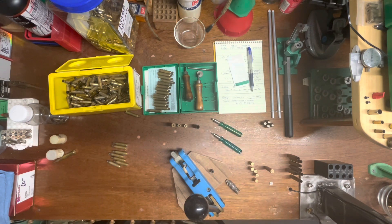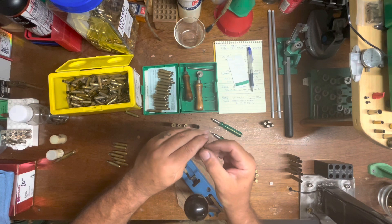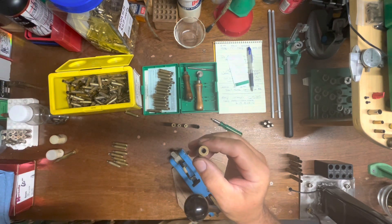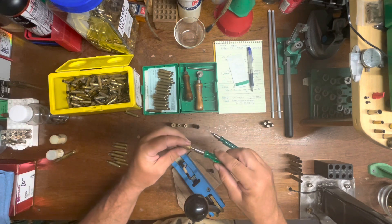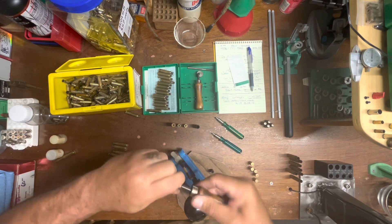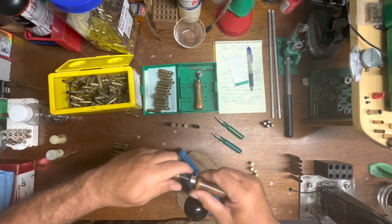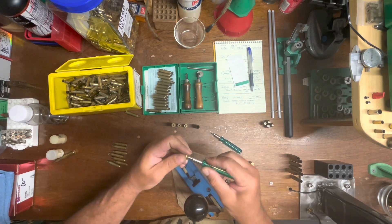Let's take this different military case — I don't know whose this is, but it's 1951. Let's deprime this on our Universal Mighty Armory deprimer. Some of these primers are really difficult to deprime because that crimp is so firm. The tool does not fit this one. Let's try the hand tool — it is cutting on this one, it didn't do much on the Lake City but it's actually taking a bite here. It didn't remove a whole lot and it's still too tight.